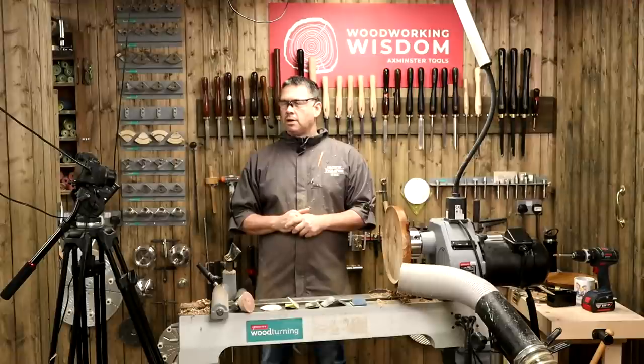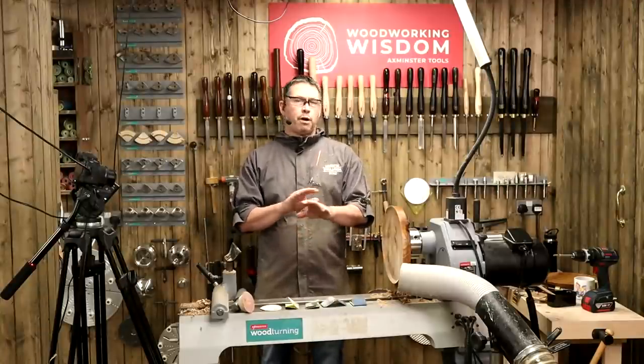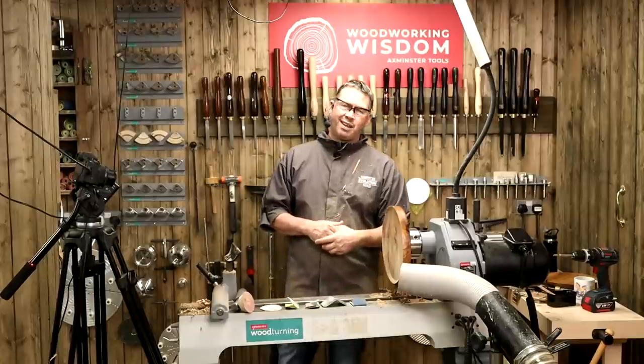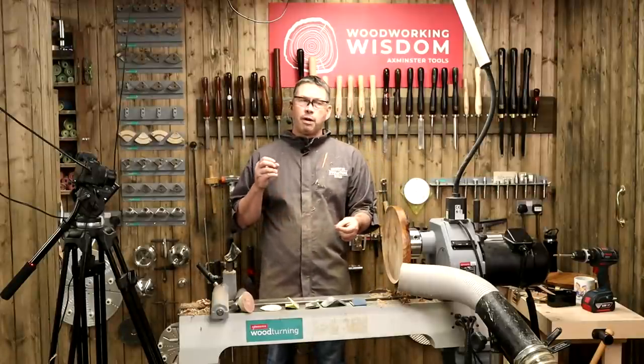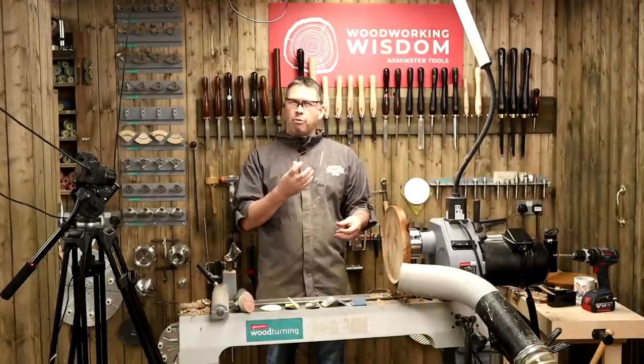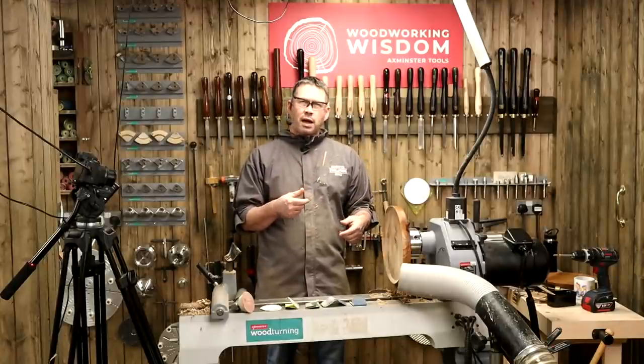Mr. Nick would like some tips for turning wenge. Just picked up some for pen work and making sure there's nothing untoward waiting for him. No, I mean, if it's pen stuff, perfect, no problem at all. If you're turning bowls from it, they can be quite troublesome. You need to sharpen regularly because it's a very abrasive timber. It's quite a peppery timber as well, and so an irritant. And also the end grain can be troublesome.